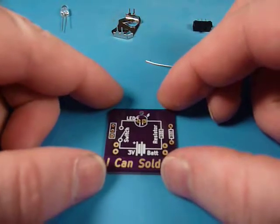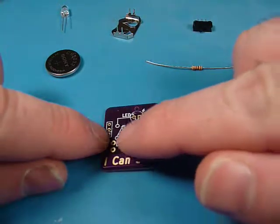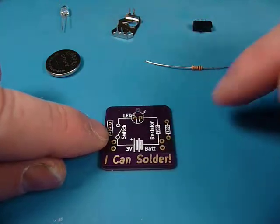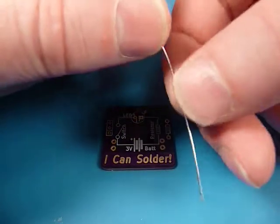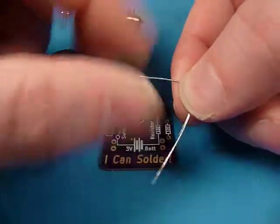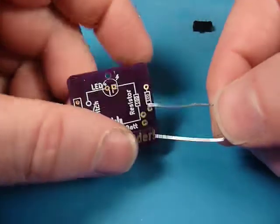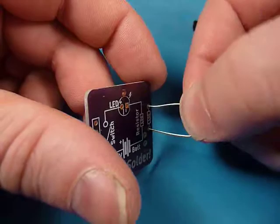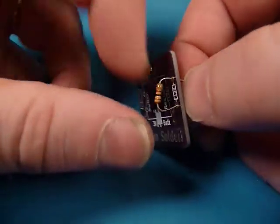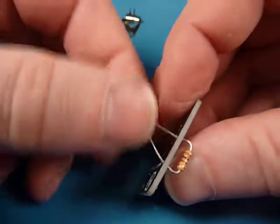I kind of tried to make the circuit board to be as self-explanatory as possible. I'll teach you a little bit about the circuit — how you use batteries, switch, LED, resistor. I always like to start off with the resistors. They don't have any polarity, so they can go in either way. The color markings tell you what the value is, and you can put about any value in here — hundreds, or 330s will work — just something to keep your battery from running out too quickly.